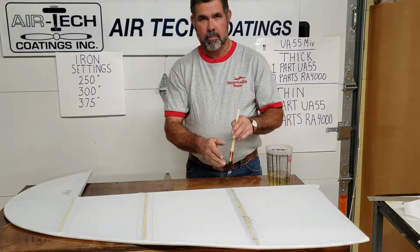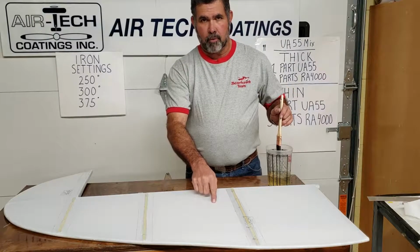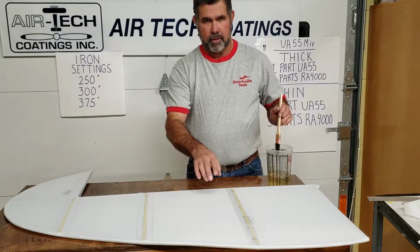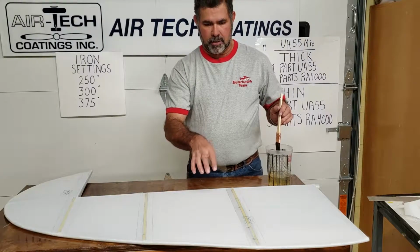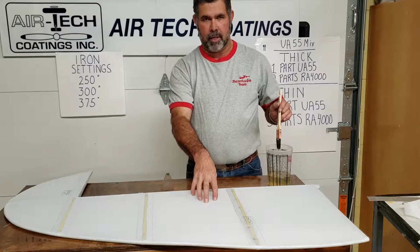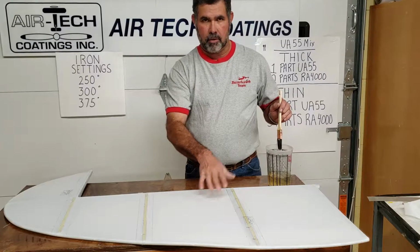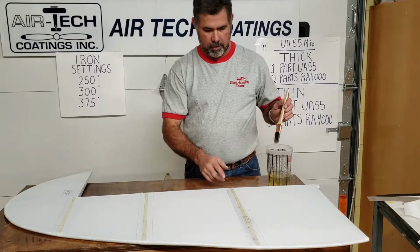We still mark them and try to keep them in, but this is going to be open weave up to the time that we put the fabric wash on and get it ready, because our system's designed so the primer goes into the fabric and holds it. There's no layer of glue under this or anything. It goes in and holds the fabric to stay flexible all the way across.